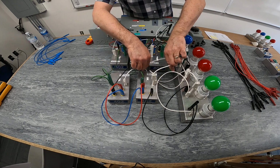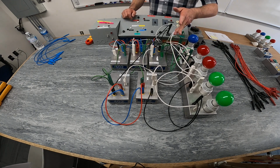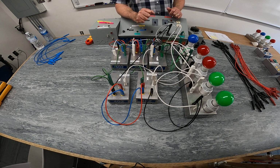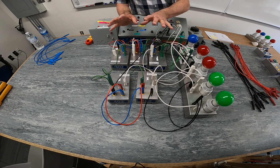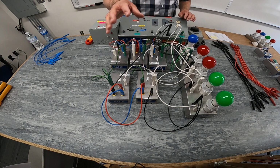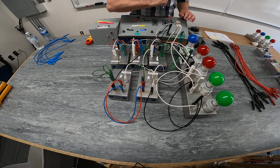Just like magic. Now, doesn't that look gorgeous? Just a couple of wires, but keep in mind that what we actually have going on here is the blue light is representing a receptacle being energized all the time, and this is all on one circuit here. We have perhaps a long hallway where we need to have 3 different locations to control 2 lights, and then maybe a stairwell having 2 switches, 2 locations here and here controlling 2 green lights.